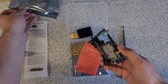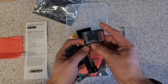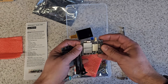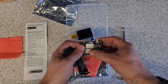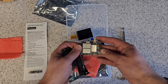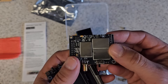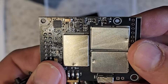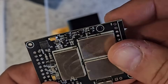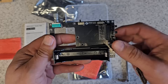It's got a web radio in it. Wow, look at that — the GeekNest radio module V1.11, and an on-off switch, an SMA connector. Then we've got some of these lovely little PCB cans that basically shield whatever is on the PCB underneath. There's actually some quite interesting electronics on here. You can see there's a BGA — a ball grid array chip — and quite a lot of surface mount components. I'd be very interested to know what's under these cans.